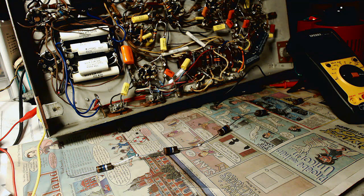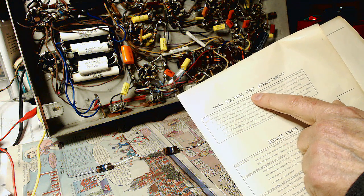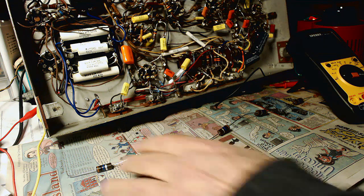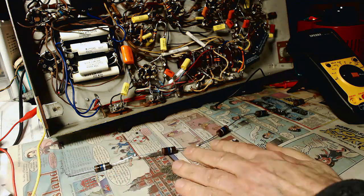So let's get started. After contacting Brendan, he suggests I do this high voltage oscillator adjustment — it may make the screen a little bit brighter. We want to check the microamps on the high voltage. What I got here is a set of five 10-megohm resistors hooked up in series.